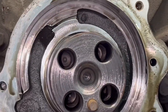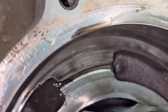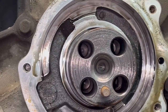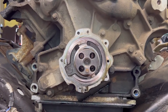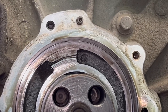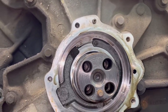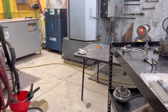That's a front cover purchase right there. It's too deep to cut. It would be kind of nice if they made a plate to slide in there with a different front cover - a different pump cover - and bring it out a little bit and give it kind of like a wear ring. That groove is not going to pump very well - it'll still pump some. Pretty much that sucks because other than that the front cover is like pristine, everything is nice - it would clean up magically, it would be great. But that groove is the problem.